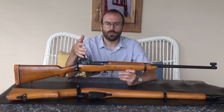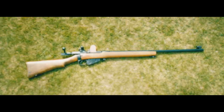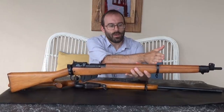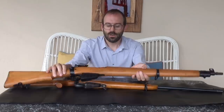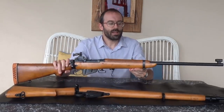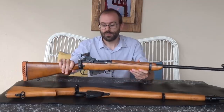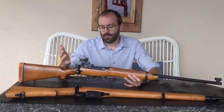The rifle has a butt probably off a Number Eight or an Envoy Enfield commercial target rifle, and a cut-down forend. This is interesting — my first rifle was one of these L39-type conversions, but it was a very minimalist conversion. All that had happened to mine was a 7.62 Enfield barrel had been fitted, it had been cut off about here with a sling swivel mounted straight into the wood at the front, and a target sling swivel on the bedding screw. This one's had a little more done to it — the forend has been shortened and the band refitted about an inch and a half further back.